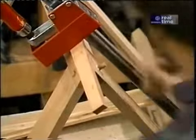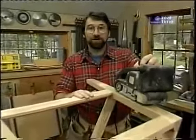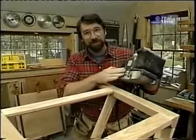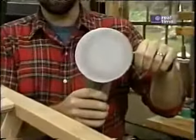Okay, this is the last pin. The glue at all the joints is cured. And now I'm sanding the dowels flush using my belt sander. After I finish that, I'll smooth everything using my random orbit sander.